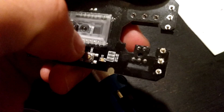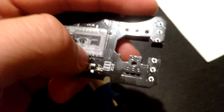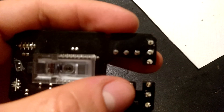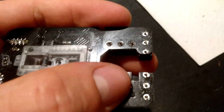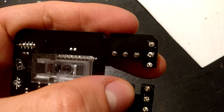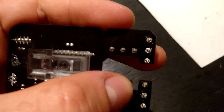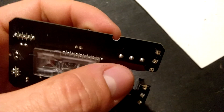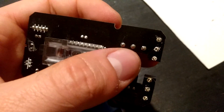You should try removing solder until you get to this point with the original switches. Because if you don't yet see free space around the pins in the rings, you should still be trying to remove more solder. Trying to yank the old Huanos out while there's still some solder left in there is gonna do no good to the PCB.